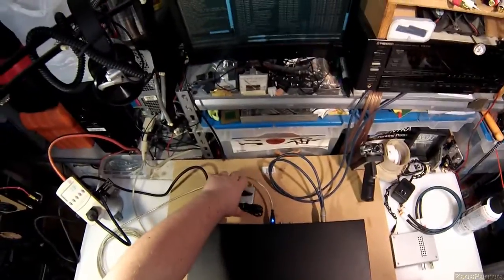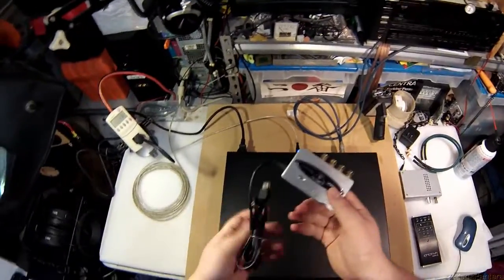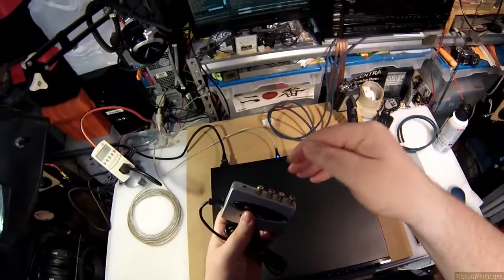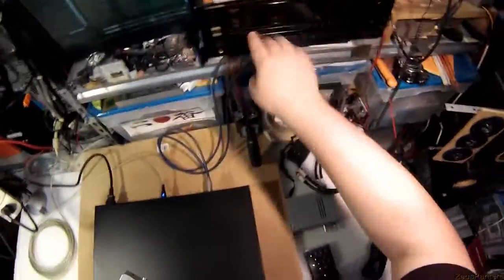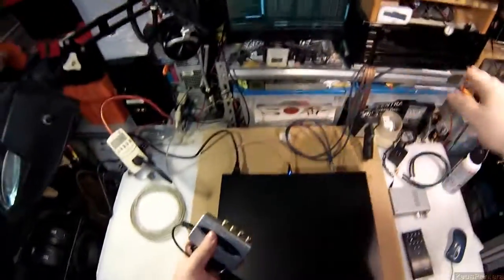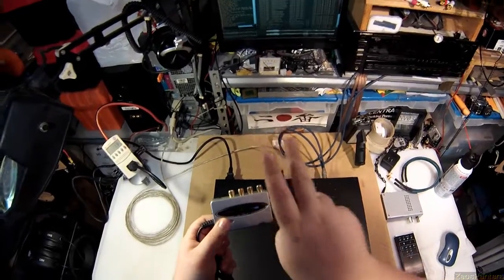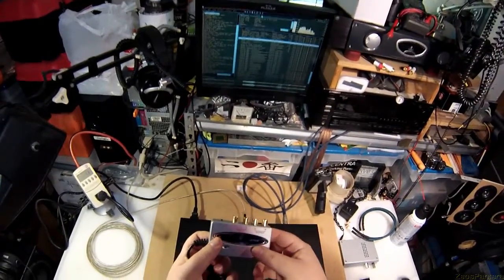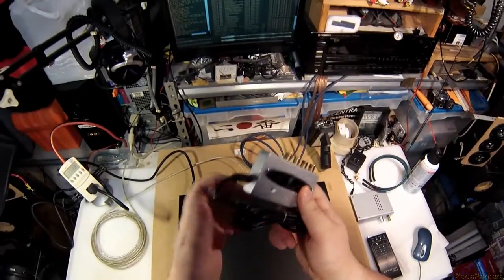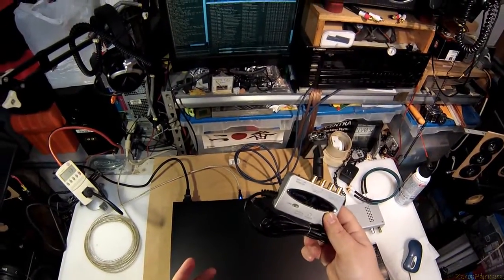In general, if you have a USB DAC, the problem is it's USB-powered — five volts. What's supposed to come out of RCA is a voltage for the left and right channel; at the top of the line that should be two and a quarter volts. It's hard to get two and a quarter volts out of peak from two channels because that would require four and a half volts worth of the five you're getting to be used as signal amplification. So USB DACs really can't do it — there are one or two that claim they do.